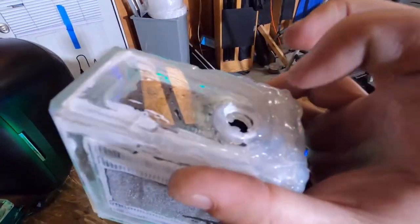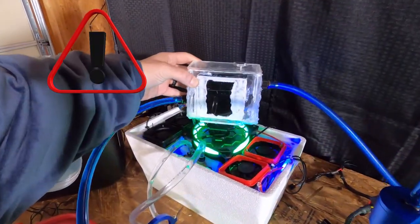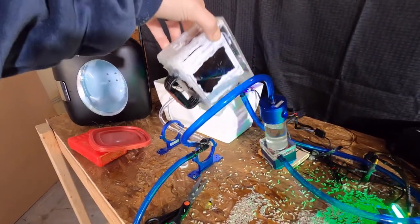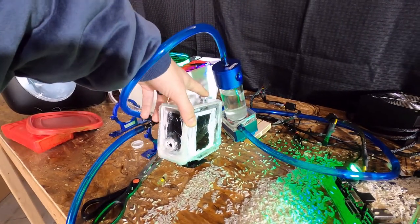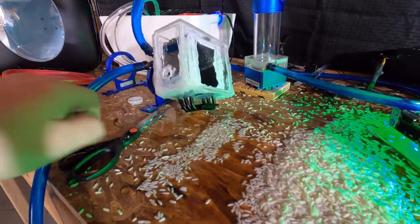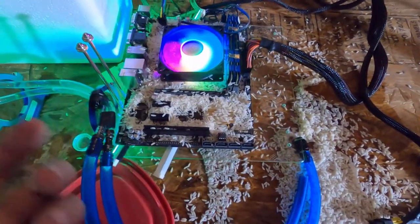super glue, and then this freaking valve broke and water went everywhere. So put all over it, and then we had a lot of water drippage up here around the 8-pin, and it caused the motherboard to boot loop, and we couldn't get it to turn on.